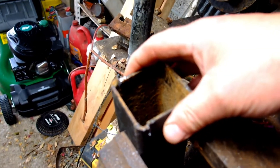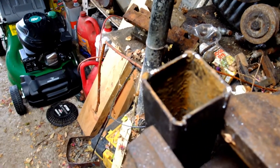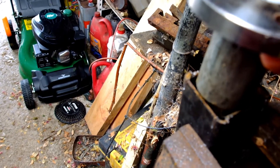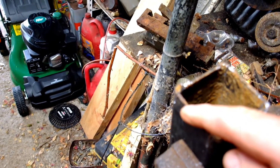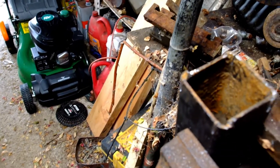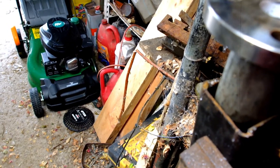At the top of the sleeve now, which is going to slide on top of our post. Just got to bend that piece in a little bit — bend that in a bit. We're going to grind the top now, then we're going to slip that in, and then we're going to weld that on permanently.